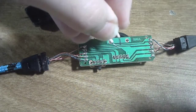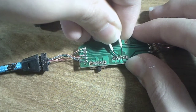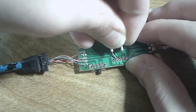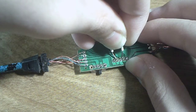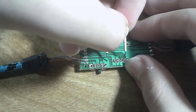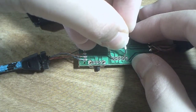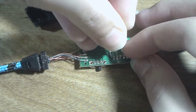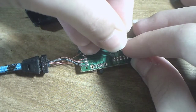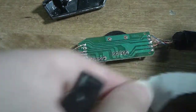I'm going to make sure to check which connection goes where with the help of a short wire and sound coming from the computer. While I jump the connection, I am listening to which of the headphones the sound is going to. And marking it down.